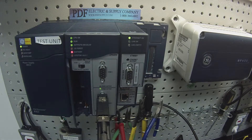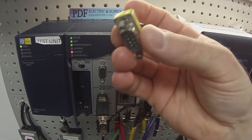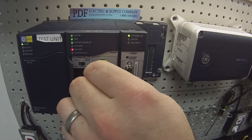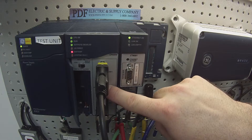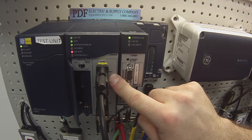Next, check COM port number one to make sure it's communicating. The cable is a female connector with the correct pin outputs. Use a male gender converter to plug into COM port number one. Once plugged in, the COM1 Active green light on the processor should be blinking or occasionally solid — that shows communication. In the software, your computer will reconnect. If I disconnect, it struggles to reconnect; when I plug back in, it reconnects. Now I know COM port one is working and COM port two is working.